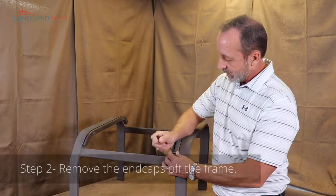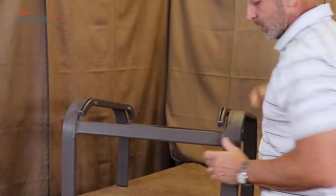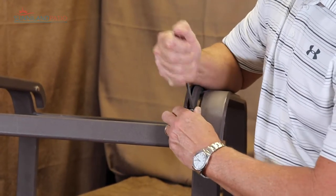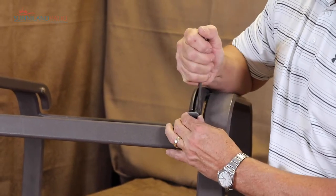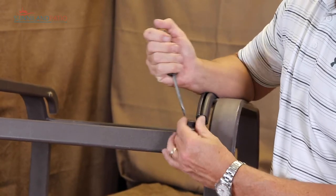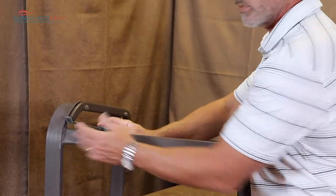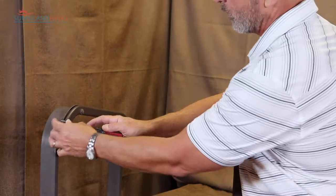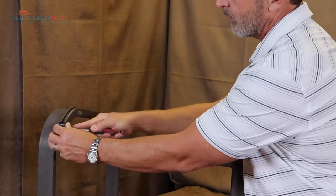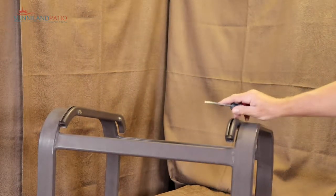Here's where we would normally take the end caps off. I'm going to take them off this side by prying in there with the screwdriver. You have to work it slowly because these caps, especially if there's a little age on them, can be a little brittle and could break on you, so take your time getting them off if possible. We do sell replacements of these sling rail end caps — we don't have every one, but we carry a lot of them. You can see those at the link below.